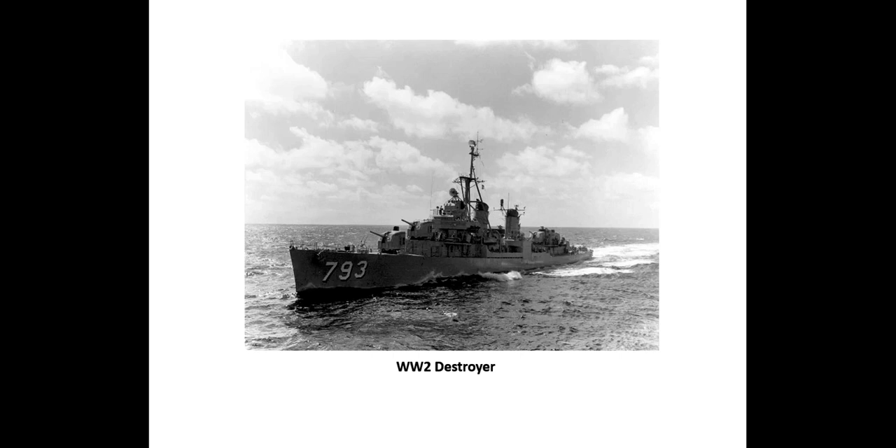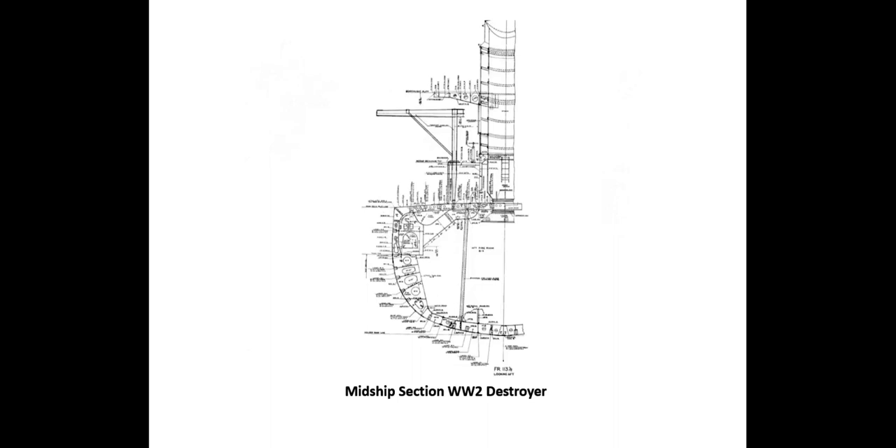175 vessels of this rugged class were built during wartime. During the course of the project, it was seen that the quality of design and workmanship was impressive given the rushed circumstances of the time. This class of destroyer is a good example of combined riveted-welded construction, with the mid-body riveted and welded, and the fore and after bodies exclusively welded. We were contacted by NAVSEA in 2012 to determine the condition of the riveted hull connections, and again in 2013 to oversee hull work needed to safely refloat the vessel, as Charlestown dry dock had to be cleared for restoration work to commence on USS Constitution. Close inspection was conducted on riveted connections, although no sophisticated means such as impact hammer testing or radiographic methods were employed.